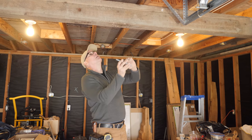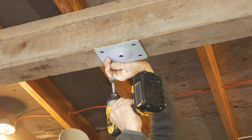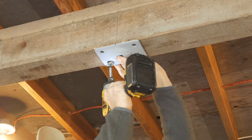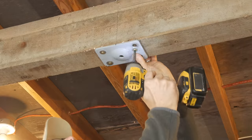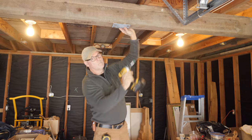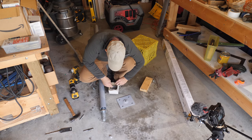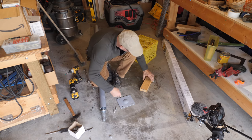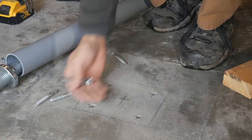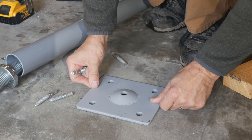There's a smaller plate that I'll attach to the underside of the beam using some washers and wood screws. I really like the structural GRK screws and I'm using them more and more in my projects — they're a bit more expensive but much higher quality. I'll be using one of the steel adjustable support columns available from almost all building supply stores. It says they can be used for temporary or permanent supports, and for what I'm doing here I think it's more than adequate.